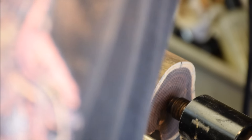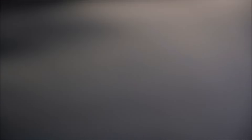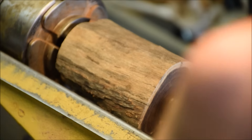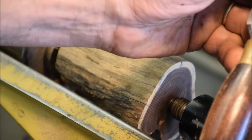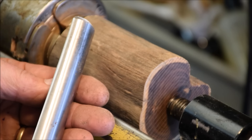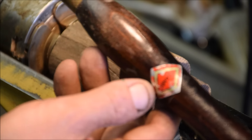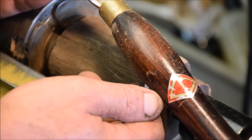So here's this small piece of acacia, or what Les believes to be acacia. It has a pretty healthy little hole in the pith right there, but since this is so small, I'm going to just turn it into a cylinder first and see what it looks like, and then go from there. I was thinking about leaving the natural edge on it, but it has some splits and checks on the outside, which I'm going to try to turn off and get away from the white outer edge — the cambium of the tree — and get down into more of the actual wood. Let's put it on the lathe and get started.